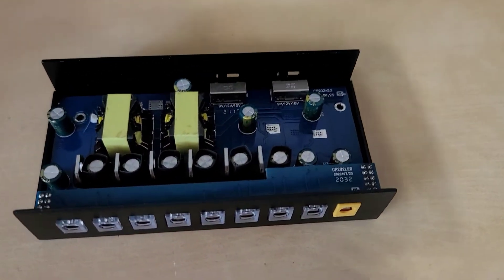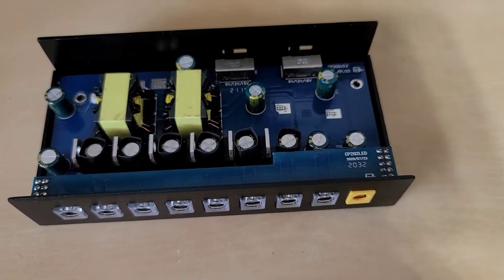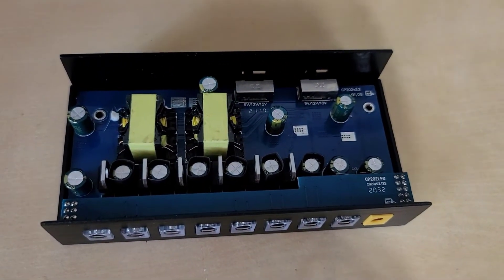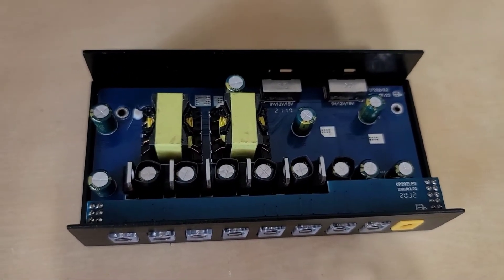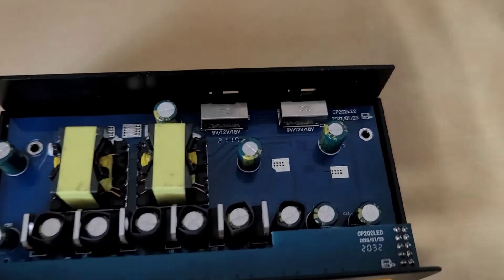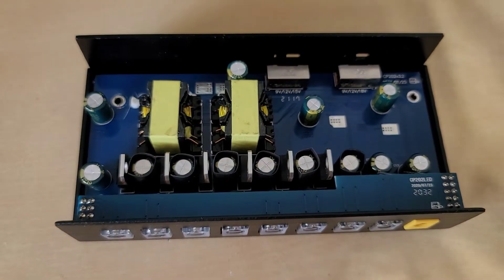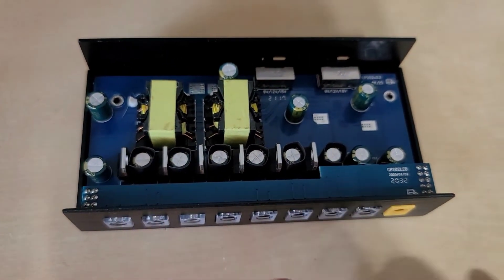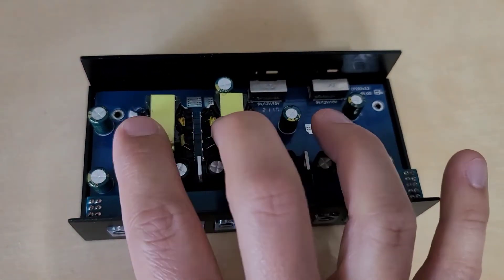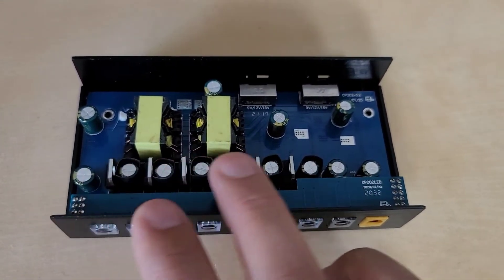Taking the cover off, we can have a quick peek inside. The board is from July 23rd, 2020, and you can see the isolation transformers right here. They're significantly larger than, say, the 206, 207, or the DC10 that I've reviewed in the past. It's a very clean layout of the IC design. The circuit is essentially where the incoming power comes in, changes from DC to AC, goes through these isolation transformers, and then the isolated power runs all these linear voltage regulators.